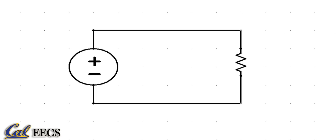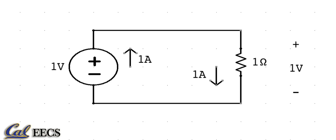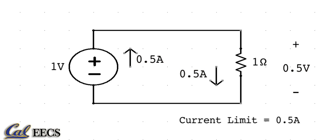Take this circuit for example: it's a 1 volt ideal source in series with a 1 ohm resistor. By Ohm's law, the current through the resistor and the source must be 1 amp. Now say this is a circuit you hook up to your power supply. You want a 1 volt source, so you set the maximum voltage to be 1 volt. If you set the current limit to a value greater than 1 amp, there is no problem — this is exactly what your circuit will be, with your power supply running in constant voltage mode. But if you set the current limit to less than 1 amp, say 0.5 amps, then this current becomes 0.5 amps and the circuit as it is doesn't make sense. Kirchhoff's voltage law is no longer satisfied unless the voltage across the source becomes 0.5 volts. Now your power supply is actually running in constant current mode, and it's essentially a current source supplying 0.5 amps.